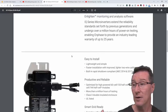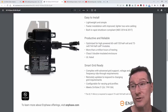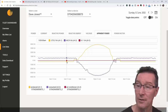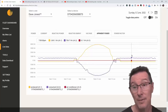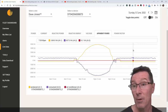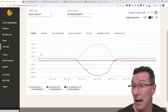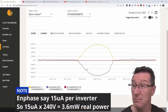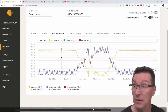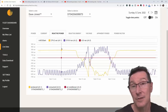These micro-inverters are switched off, but they still have large capacitors on the output connected across the mains, which causes this apparent power flow. I hope that answers the question many people have asked: what is the standby power of these micro-inverters, and does it make a difference? Well, what you're paying for — nothing. But it is interesting to note that they do draw 280 VA because of the capacitors on the output.